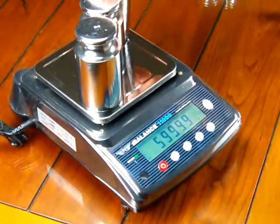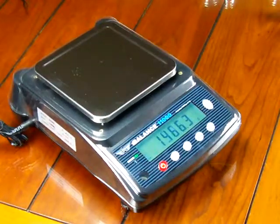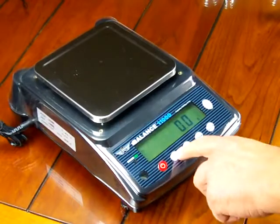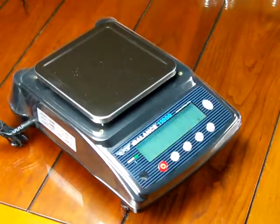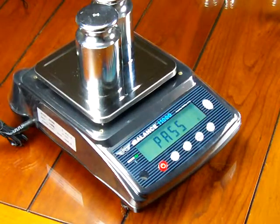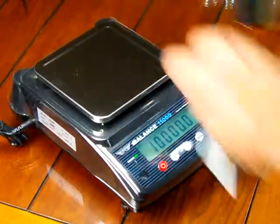Let me show you something about the scale which is an issue we've seen before. If you go into the calibration and use the wrong cal weight, or you don't put the weights on quick enough, what will happen is the scale will store whatever weight you have on there as 10,000 grams. So it's flashing 10,000 — we'll put 4 kilograms on the scale. The lines go across, it shows 'past,' so it's accepted 4,000 grams as 10 kg.